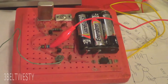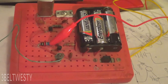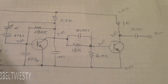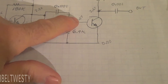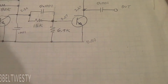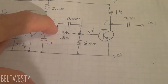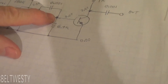There's the Science Fair 100 kilohertz marker generator kit and it seems not to work. I've gone through and traced the schematic out, and what I found is that this transistor here is probably dead. The base should be about six tenths of a volt above the emitter, but it's barely above it. Right now I've got a wire connected over here and connected up to the antenna.